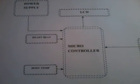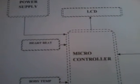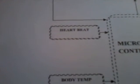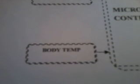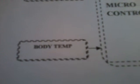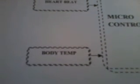It's a 32-bit processor, the LPC2148, and we are using some sensors: a heartbeat sensor, which is an IR photodiode based pulse sensor, and an LM35 precision temperature sensor, minus 55 degrees centigrade to 150 degrees centigrade. The data is displayed on the 16x2 LCD display.